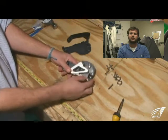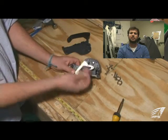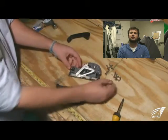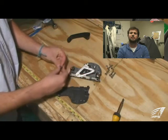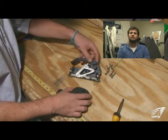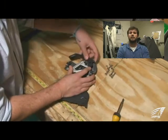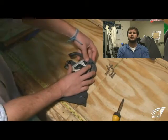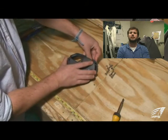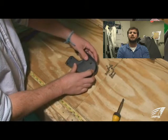Back to putting it back together: when you slide the base plate and the cam back in, make sure that the cam is sitting on top of that plastic piece and that the pin on top of the cam is seated correctly. Don't forget to put the fairleads back in place. You can start by laying the handle back in place as well, and when you put on the matching side plate, make sure that all the pins and different fittings line up correctly.